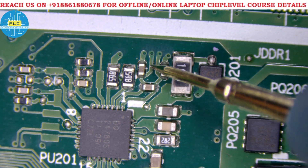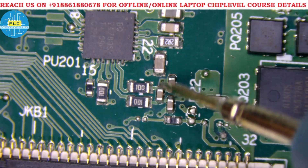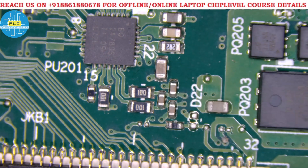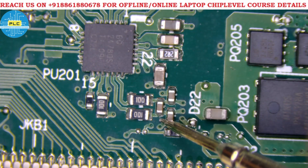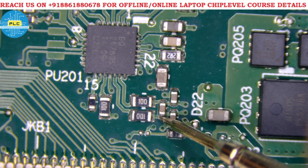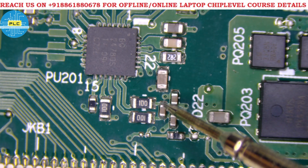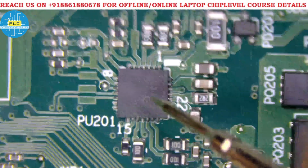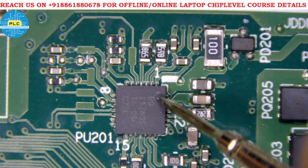Pin one is ACN and pin two is ACP. Also two and three are there — the positive side and the negative side. In battery section these are called SRP and SRN. So four pins are accounted for. The capacitors here connect to each pin — positive and negative side — but they should NOT be connected to ground. These are filter capacitors that bypass unwanted voltages. Here is ground, and here also ground. So pins one and two are ACP and ACN.